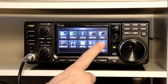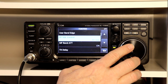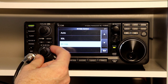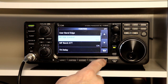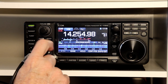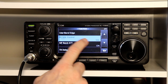There are some options. If we press menu, and we press set, and then we go to the function menu, on the second page down, RF slash squelch control — RF plus squelch is the mode that it comes preset to, so you have both squelch and RF gain. The next option is just squelch. In this mode, turning all the way to the left doesn't do anything, so it's only acting as a squelch control and nothing else. When you set it to that option, the RF gain is just fixed at maximum all the time.